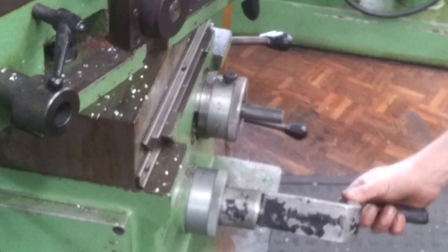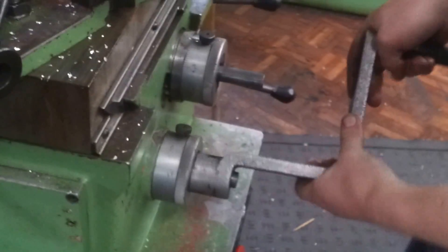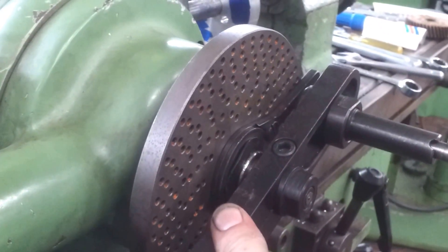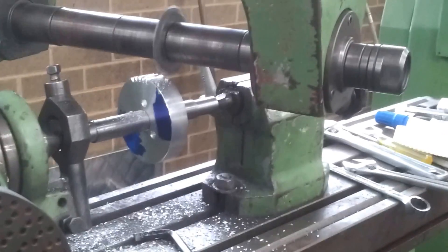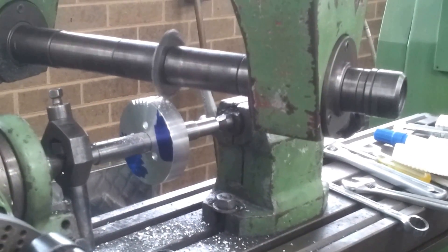We're just finishing our next tooth here when it stops cutting. Disengage the feed. We have to wind the table down because of the backlash issue, then rapid this back to the start. Stop the feed, take up that one full turn again, index for our next tooth, and here we go for the next tooth. Okay, that's a wrap — thanks Byron.